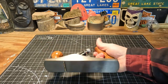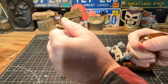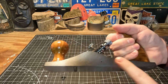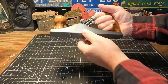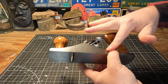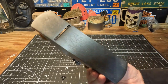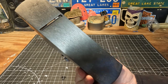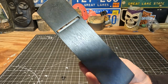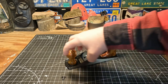It's very lightweight and small, but I feel like it's big enough to do some work with. However, the edges where your hand grabs are very rough — not a good finish at all. The sides are really, really rough, like they passed over it with a milling machine super fast. Same with the bottom — it's really rough, and I doubt it's anywhere near flat. There are a lot of machine marks on the blade too, so we're going to have to do a lot of work to get this thing functioning properly.